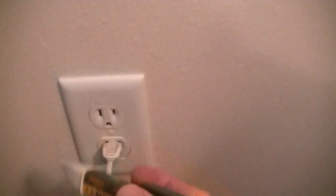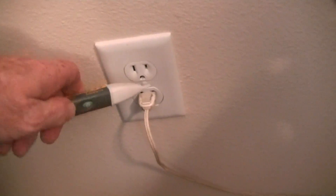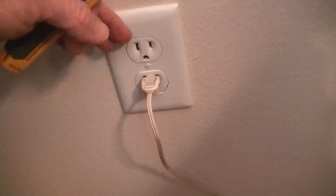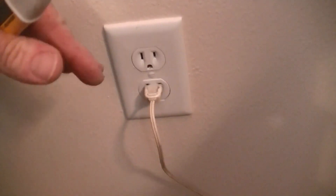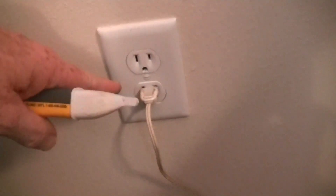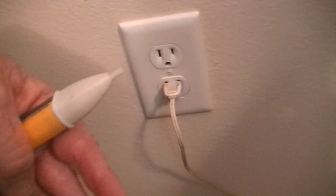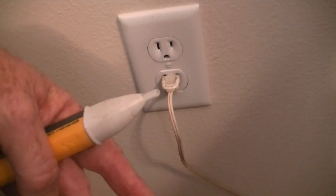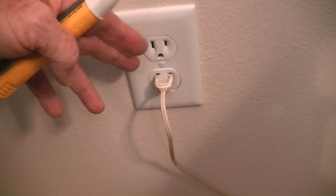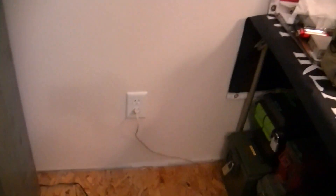On the subject of safety: never plug in a radio to your outlet and go to the breaker panel to kill power — unless you wired it yourself. A lot of people plug a radio in, hit the breaker, and assume all the outlets and lights in the room are dead. That's not always the case, because half your outlets could be wired to one breaker and the other half to another breaker. You'd plug in, listen for the radio, turn it off, and think all the power in that room is shut off — and that might not be the case.